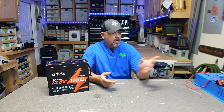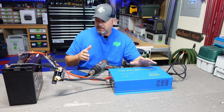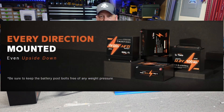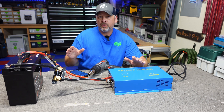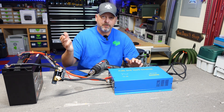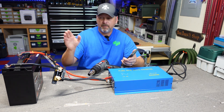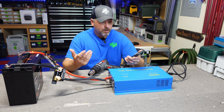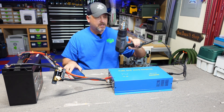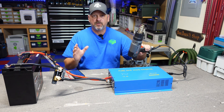I want to run it on my little inverter to make sure it handles at least 100 amps, which is what the BMS is rated for. I've got my XYZ inverter hooked up to the battery. One thing I didn't mention is you can mount this battery in any way, shape or form — on its side, on its back, upside down — which creates a lot more options when fitting it into a small compact space. I've got the Victron smart shunt in between the battery and the inverter so you can watch the amp draw. Right now we're sitting at 13.68 volts. I have a heat gun and I'm going to get to around 95 amps and let it run for about 10 minutes.